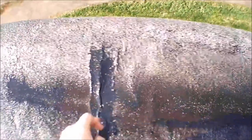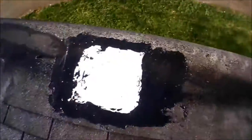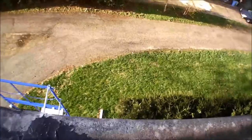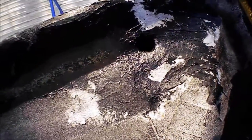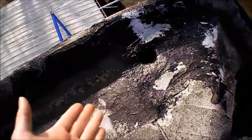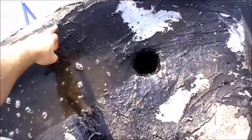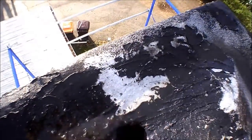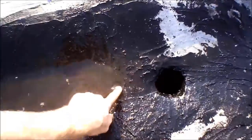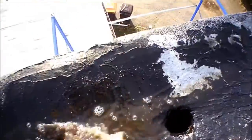It's probably just overflowing off the side. Right here is another little crack where water is penetrating in there and going through the soffit. I did this one — I probably need to do another one there if I don't fix this soon. Again, this is 30 feet up. There's my scaffold. Here's the other gutter right here, and you see the water — it's leaking through here. I put a lot of tar in here, so I'd assume it's getting in through some cracks. It could be going through any little crack, and you can see it's kind of sitting water — it's not working all that great.